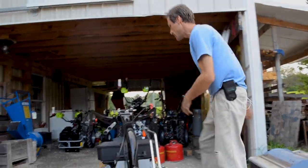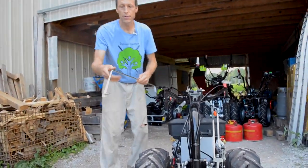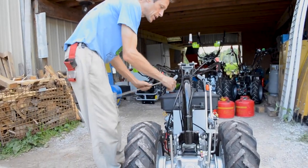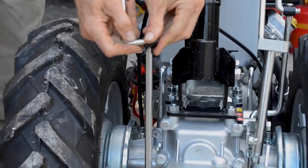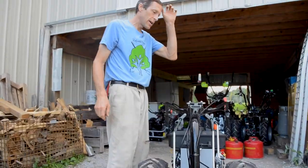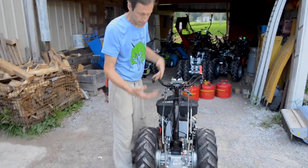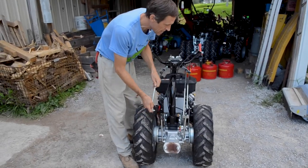Get in there. I'm not going to bother putting the pins on, you can see how it goes. And of course, the gray one is color-coded correctly, and it doesn't matter where you put that because you've got two open holes over here now. Bring it through here, and you're hooked up. As I say, the differential lock just has to be done manually down here. So now you're ready for your mowing applications, or snow blowing, or chipper shredding, or whatever it is going to be.